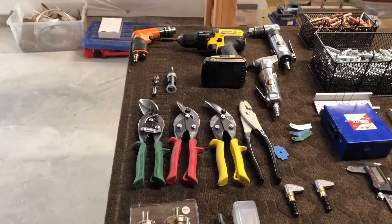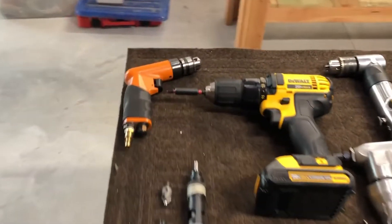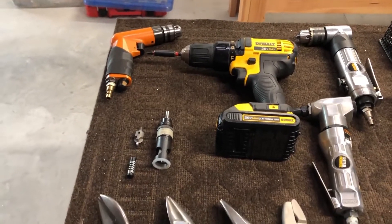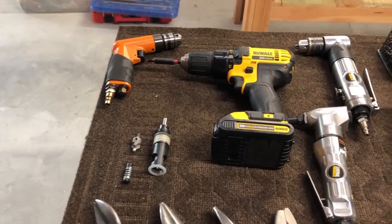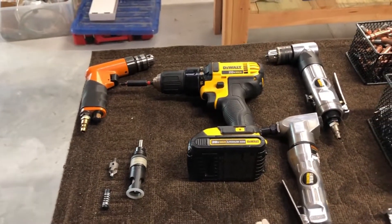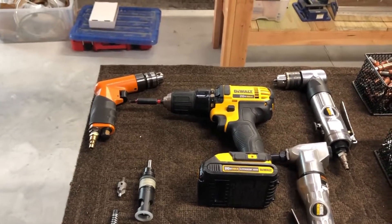When we look at the fabrication side, when we're prepping all the parts, I have the drill — this is an air drill. Works really well, spins very fast, 3000 RPM, and it makes for really neat holes. I have the battery-operated drill as well. I use that when it's something quick and it's not easy to get to with the air hose, so that works out well.